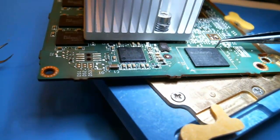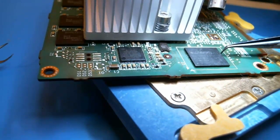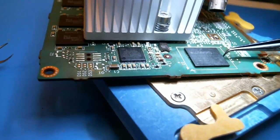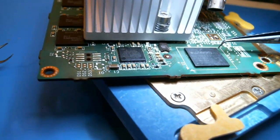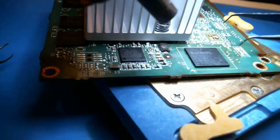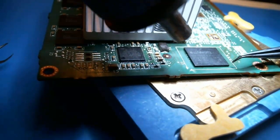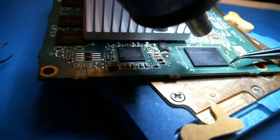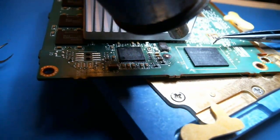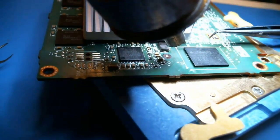What I'm doing here — I think this uses the 153, 198, BGA chipset? I don't remember exactly what BGA chipset it is, but it's a fairly standard one. I just re-balled it, and the blue thing below is a preheater — a Mechanic IX5 preheater. Get it for about $30. Initially I didn't use it and it didn't work the first time, so the guy wanted me to use a preheater this time. I did so begrudgingly, but it seemed to have worked.